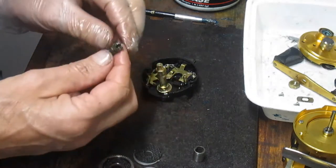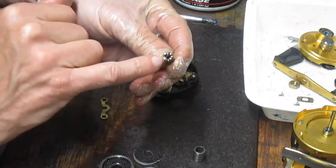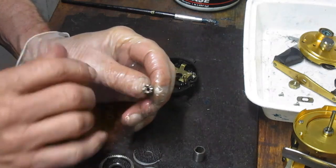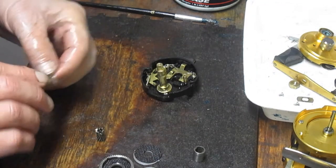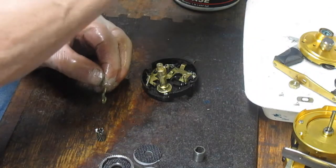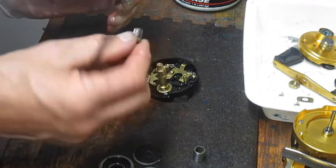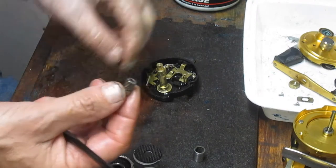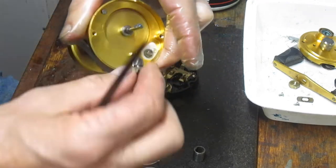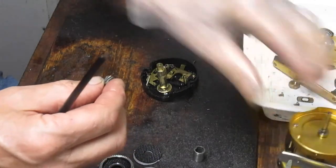The yoke is complete. The spool's got two sides. The pinion gear has got two sides — the spool side, which has got the plus-sign kind of cavity in it, and a flat side. This goes towards the spool. I had somebody send me a picture the other day saying their spool wasn't turning after reassembly. We looked at the picture and found they had the pinion gear in upside down with the smooth side facing. This gear rides on the shoulder of the spool — you'll see that little pin sticking out. If you put it in the wrong way, there's no way it can grab the pin and it just won't spin.